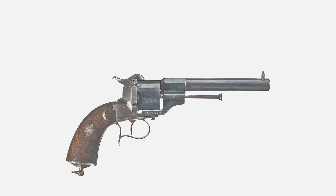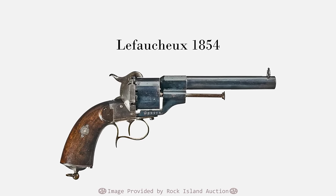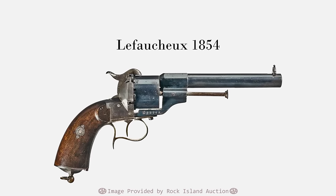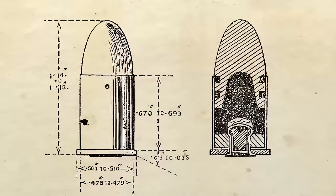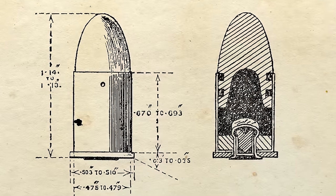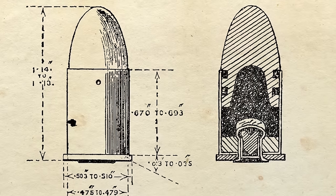Regardless, as far back as 1858, Boxer was on record as preferring rear-loading metallic cartridge technology with an appreciation for the pinfire Lefaucheux. John Adams' revolver likely satisfied Boxer's own conditions, so he supposedly took on the task of designing an ideal cartridge for this conversion. The result was 450 Adams, a black powder centerfire metallic cased cartridge. The bullet diameter now made use of the existing bore. The initial version used an iron rim riveted to the drawn brass case.